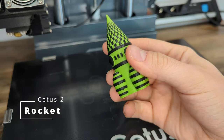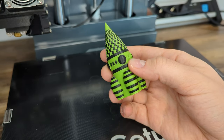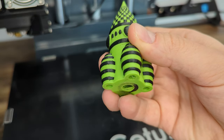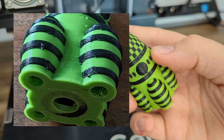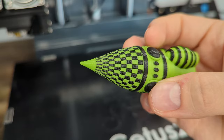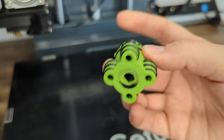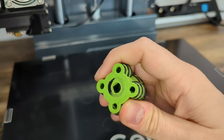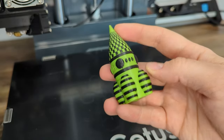So let's have a look at the finished rocket. First up, I like the color separation — there is no mixing, no artifacts, everything looks clean. Really nice. One thing I notice are the fallen lines on the bottom of the rocket. It looks like my first guess about weak part cooling may be right. Other than that, the rocket looks really nice, especially at the top where the checkerboard pattern gets smaller and smaller. At the bottom, we see that the inner part of the rocket was used as a purge tower, which was a smart placement since it saves filament that otherwise would have been used as infill — so good job, TierTime.